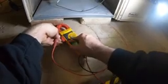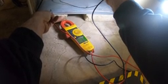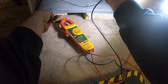Staged up. Inducer has not got anything yet. Inducer should be spinning. Okay, let's check, 6 volts here. So right here I have 6 volts to my motor. Okay. Any burn marks?